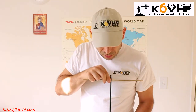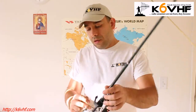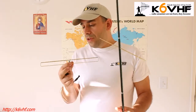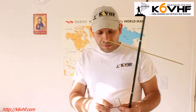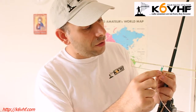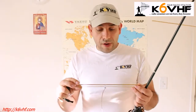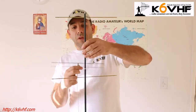So we have two elements right now, but something is definitely missing — of course, it's the driven element, the active element, which is over here. I unwrap it and as you can see, I just put a small piece of PCB. I got one piece from old PCB and just soldered it so the central conductor and the shield are soldered directly to the ends. This is the modified one. As you can see, there are different diameters, but it absolutely doesn't matter what you're going to use, because you get it tuned later.